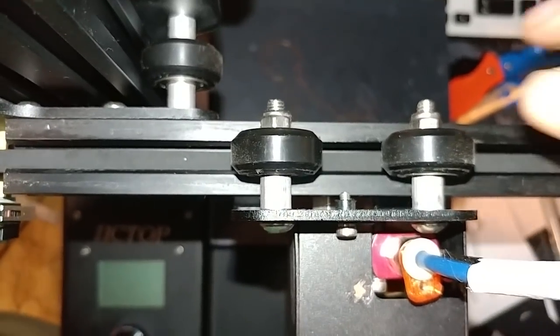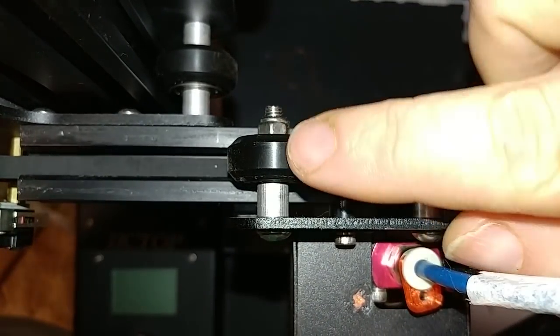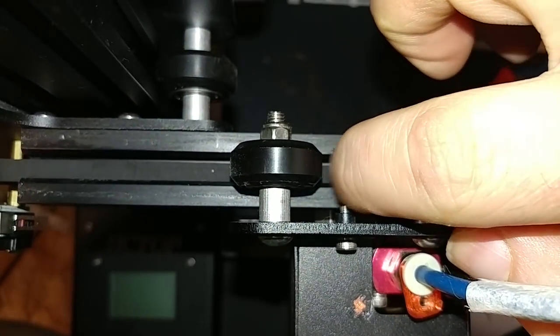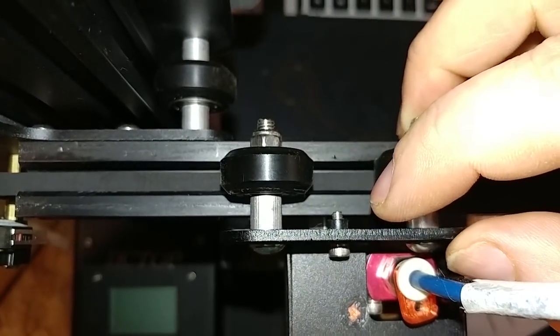Thank you. So you have a spacer. You have a bolt, which goes straight through. And you have a nut. The spacer is to make sure that this and this are relatively positioned, so that the wheel sits right here and this sits in the right spot. So tightening up this nut does not adjust this too much. It can for this. If this arm is loose, just tighten up these and that'll fix that problem.